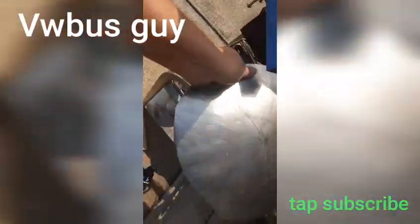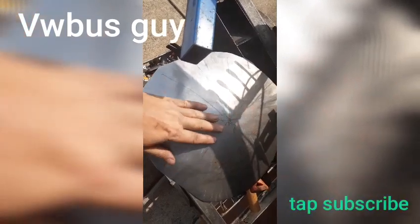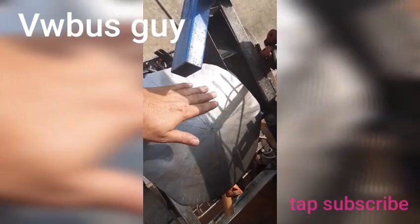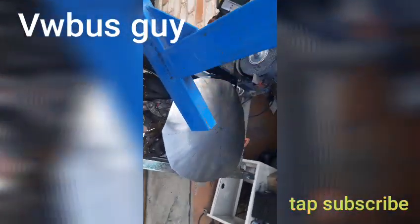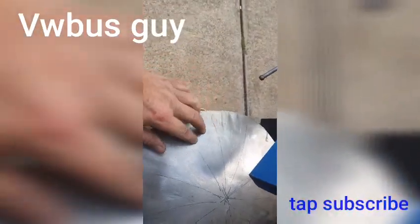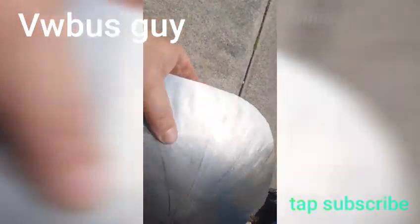So what I did is, I used this one, very high crown, and basically took the chatter out with all of the lumps that were in it. So it sort of flattens it and it creates a bit of a dome. So then I go on to the next one, which is a number 2 wheel. It's less of a dome, and that sort of flattens it out even further. And then you start to see all of your imperfections. You can see those ripples there.